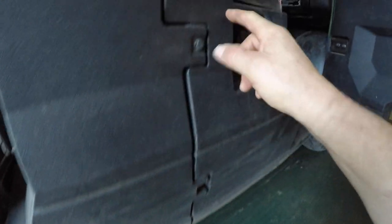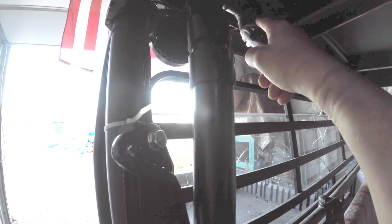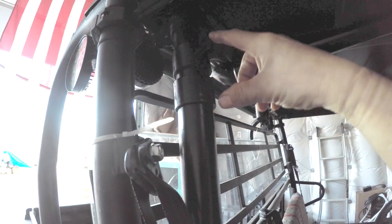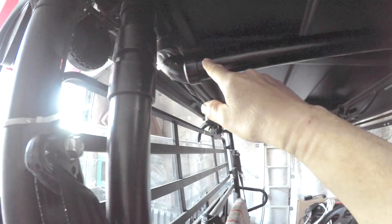It went through here and came up — right there. I used a few 45-degree fittings, not 90s — 45s through here, and there's another 45. I had two 90s sitting here, but my wife said it was too noisy over there getting all the suction. I'd already glued it together, so I put it in two pieces. My suggestion is don't glue it together until you get the final outcome you want, in case you need to raise it up using those 90s.